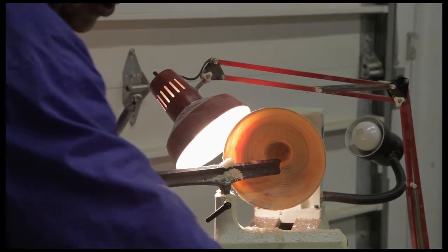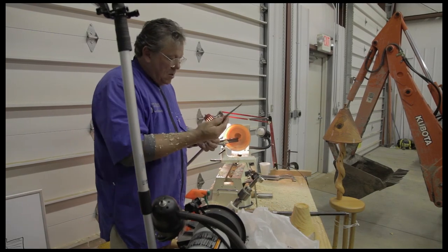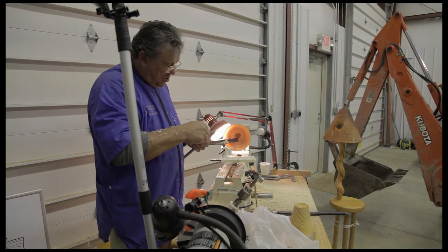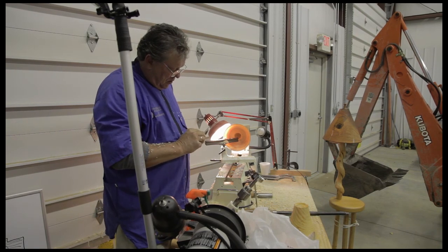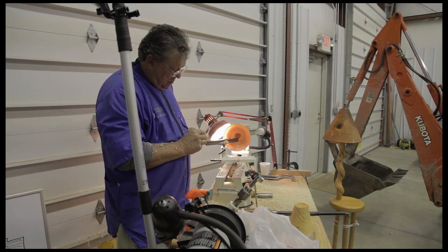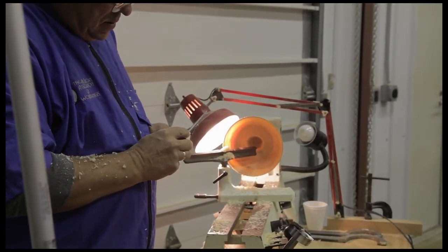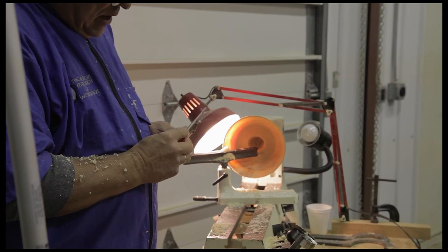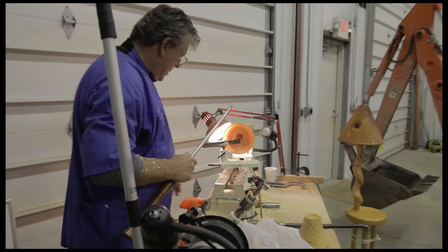And to sharpen them, you have your choice of a Dremel with a cone-shaped stone in it, or a little diamond hone, which you can run both inside the curve and outside the curve and just dress it like that with a diamond. It doesn't take much to restore that edge. And you really don't want to grind these any more than you have to because you have to make a new hook when they're ground away.